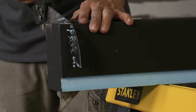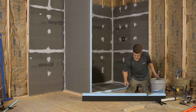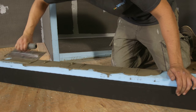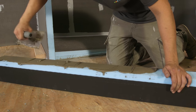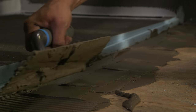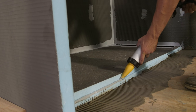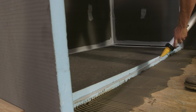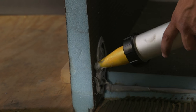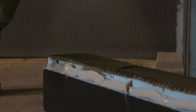The curbs are sloped on the top so that water flowing down from doors will easily be let back into the shower. The curb is cut to fit tight between Wedi walls. Thinset mortar is applied to the underside of the curb using a quarter by quarter inch square notch trowel, and the same procedure is repeated on the floor so the curb can rest in full thinset support. Wedi joint sealant is applied in continuous half inch beads in the shower base z-notch channel, over the full attachment surface where curb ends meet the walls, and at the vertical z-notch area of the curb where it meets the shower base z-notch channel.